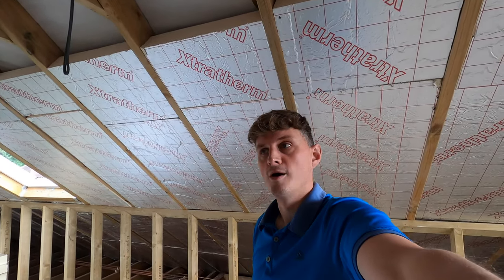And I've actually been doing even more in the small roof back here, which you probably can't see, but that's 300mm in there as per building requirements. So I'll continue with the time lapse today. I am putting the insulation in here. Again, you can put up to 100mm in here because you've got 100mm depth. I don't have to put in 100mm, I'm putting in 50mm because again, I took the insulation all the way down. So I made this zone even more insulated than necessary. So I can put 50mm in here and the room will be as watertight, as insulated, especially as I'm using the extra firm, thick stuff rather than just wall insulation. So that should be more than sufficient.